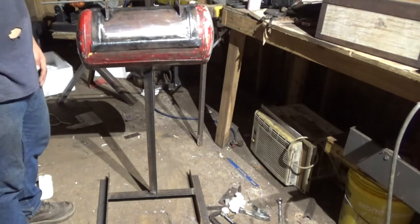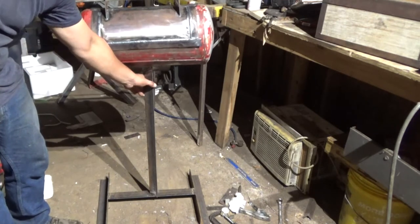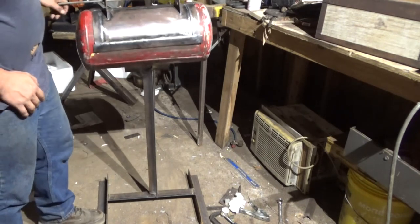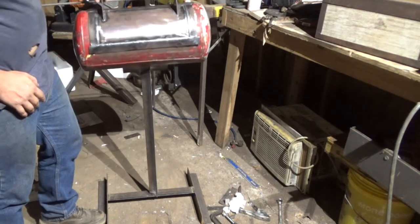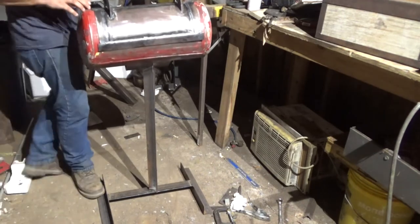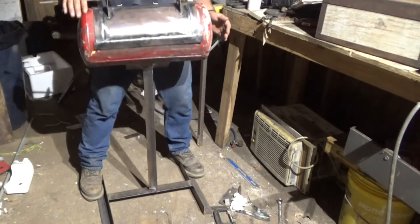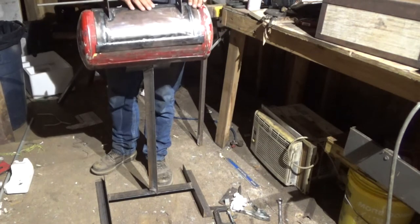Here it is — a pretty bad feel. This one-eighth inch thick 2x2 angle iron, I thought it was a lot stiffer than it is. It just flexes way too much. And I turned the lid into a banana — it doesn't sit down straight.